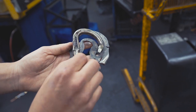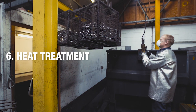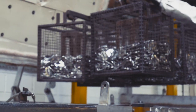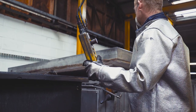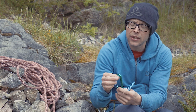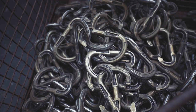The next job would be the heat treatment, and that doesn't change how a carabiner looks, but it really affects the strength of the carabiner — a lot of strength is added in that heat treatment. You put the whole batch of carabiners into a furnace, heat it up, and it changes the atomic structure of the carabiner, gets rid of any weaknesses which might be in that alloy. It can almost double the strength of the carabiner.